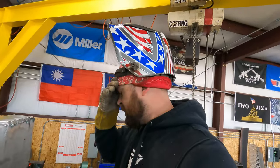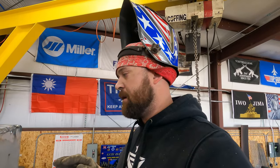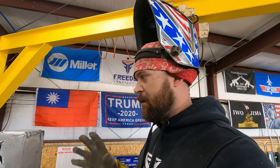So I'm gonna be real with you guys. This does not look the greatest, but that's dirty, nasty, crappy base material because it's a dump truck that hauls dirt. So I'm gonna show you guys what it looks like because I want you to see that sometimes in the real world, you gotta run two or three or whatever crappy passes and burn all the crap out of the base material and it looks like crap.